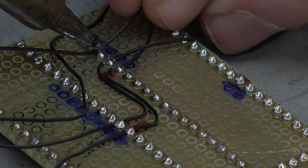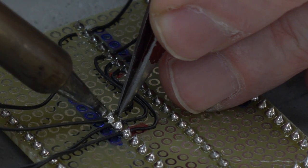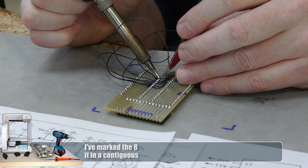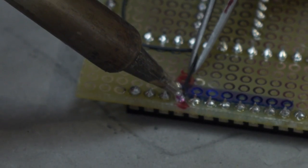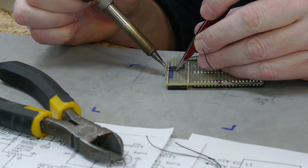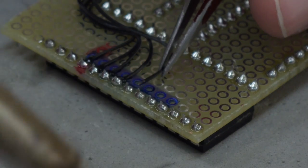Note how I keep all of the wires on the same level, just like traces on a circuit board. This helps me keep track of the signals and also reduces the space consumed by the circuit, since I'm not piling the wires on top of each other unless absolutely necessary. The abundance of solder on each pin helps me here — there's lots of surface area to hit with the iron to make sure it heats up the solder to attach the wire. The solder should surround both the wire and the pin for a good connection. It's kind of a cheap method, but you can strip wire by heating the end and causing the plastic coating to contract, exposing the wire. It's not always clean, but it is handy when the connections are too small to reach with your cutters or fingers. I'm trying to keep the wire ends on the side of the pin so I know there's a good connection — it's soldered along the wire instead of just the tip of it. If it is just the tip of the wire connecting, we might not actually have a very good connection and it can break easily.